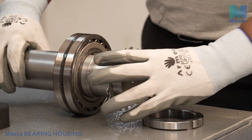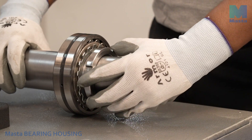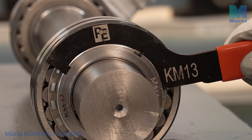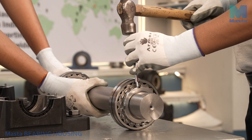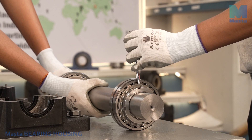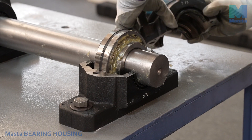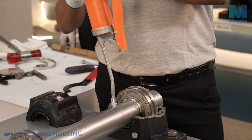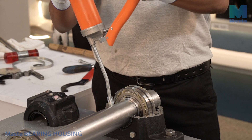Once the bearing is located at the proper axial location on the shaft, remove the nut keeping the bearing in location on the adapter sleeve. Then insert the lock washer and lock nut, and tighten it until fully tight. Secure the bearing assembly by bending the lock washer tab at the appropriate slot in the lock nut. Check that the shaft and outer ring of the bearing can rotate easily by hand for a correct fit. Fill the bearing with grease thoroughly and put the recommended quantity of grease in the housing base at the side.